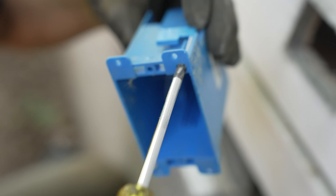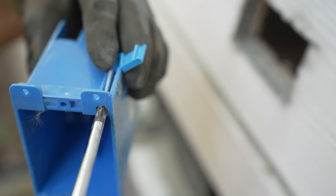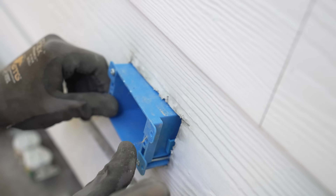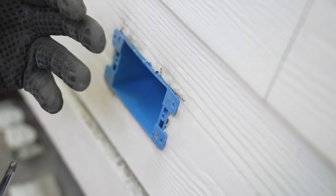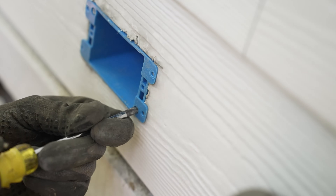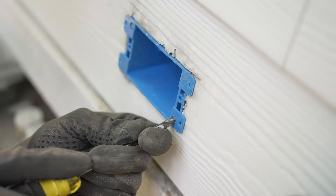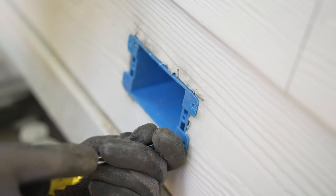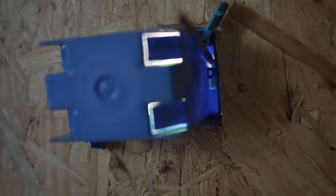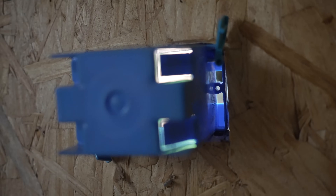I've adjusted my tabs — they come from the factory closer in than that. I've backed them off, lefty-loosey, to get them fully out because I've got two layers to go through. So I'm going to flop them to the inward position after they're loosed up. I can see it opening up and it's grabbed. I'll tighten that down. It's not opening up all the way, so I'm going to reach in there and pop that sucker open. Don't death grip it — it only needs to be snug. My box is set. It's time to strip, poke my wire in, and terminate the receptacle.